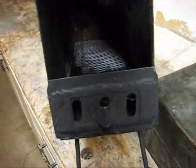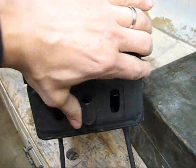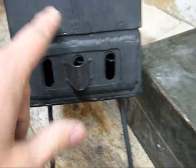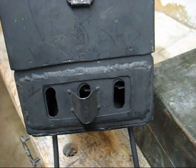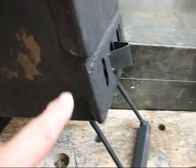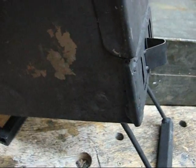Of course I've got a welder. You could do this without a welder. Instead of this funky fresh air grill that I've got here, you could just do, like I talked about earlier, just a single disc with a hole, drill 4 holes, and then of course when you turn the disc about 30 degrees, 15 degrees off, it opens up the holes or closes them up. The second thing you could do is on here, instead of welding, you could just drill holes and use rivets.